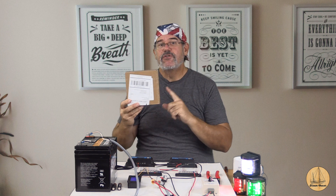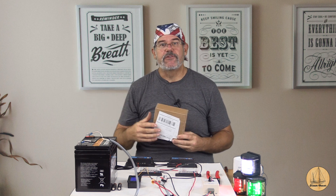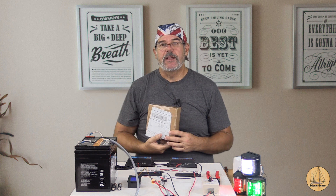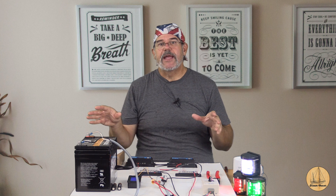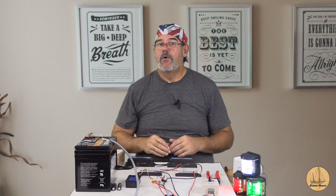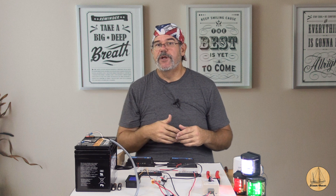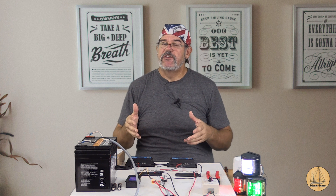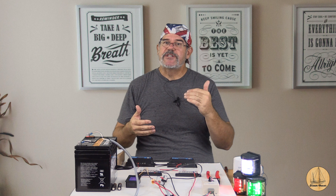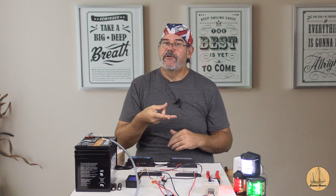In this week's video we're going to hook up a two-way battery monitoring system. What I mean by two-way: it not only measures all the amperage coming in from external sources — whether that's solar, wind, or an electrical battery charger — it also measures all of the loads going out and gives you net calculations along with the battery level. The challenge with the small cheap one we used before was it only measures one direction, so when you wire it into the shunt it measures loads coming in, but if you start to take a load it would decrease to zero and start counting up again in a positive manner — it didn't go negative.